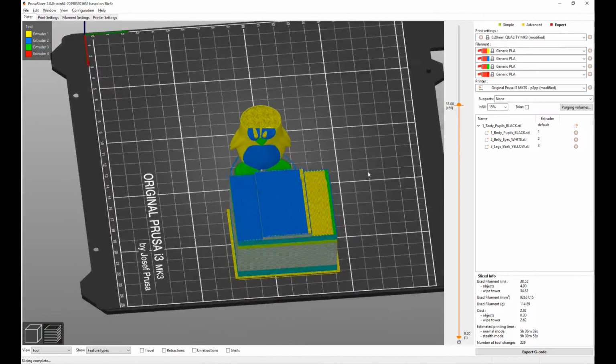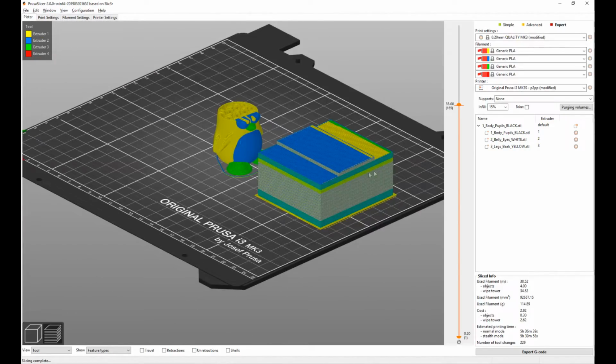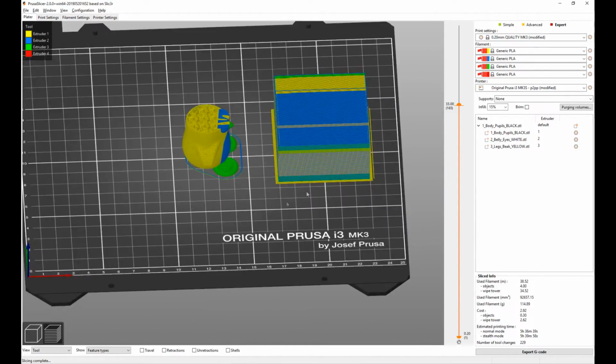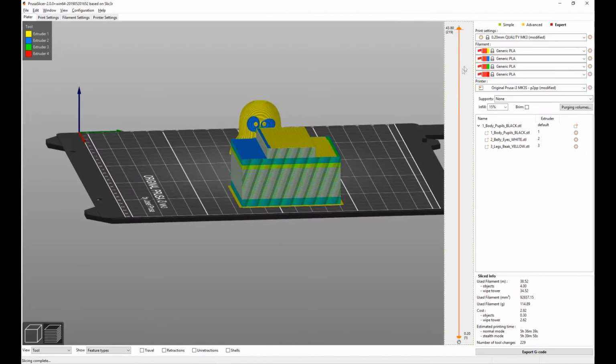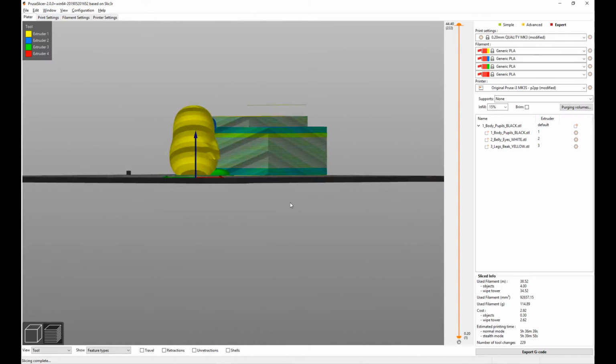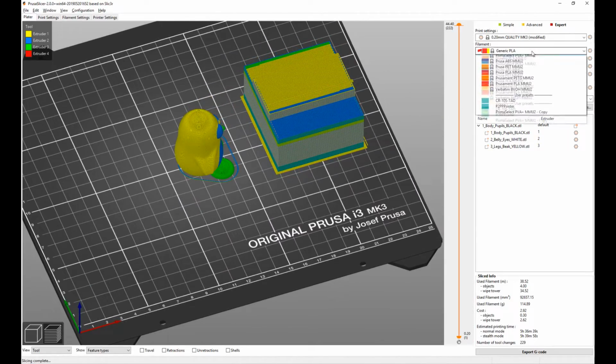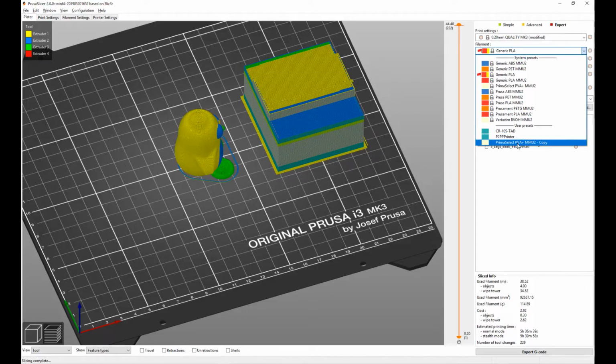It was hard to see. Oh yeah, okay, so from here on to the top, we're only using 2 colors. Now it actually reduced the total size of the purge block until about this point there, and there it stops building the purge block because the rest is just a single color. And okay, yeah, here, let's see if we can visualize that better. You see, when we come to the top, it will do what I talked about earlier. It tries to extrude some filament in midair. By the way, the reason for that is that we have not switched to use the modified versions that we made.